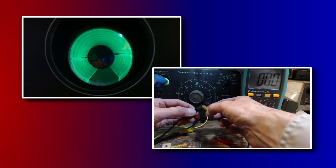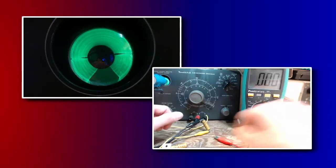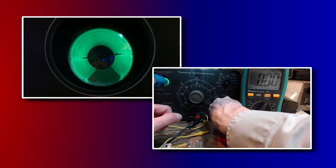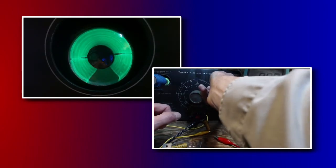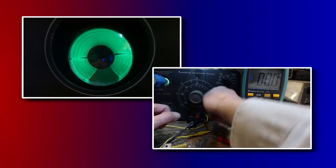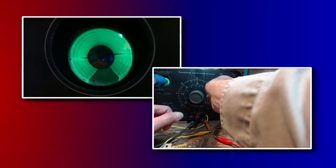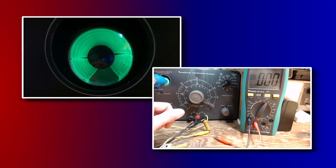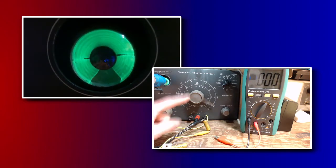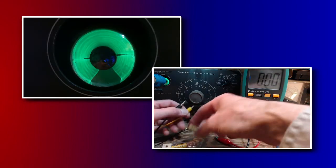This is C2. This is 350. It's a very good capacitor. The top voltage this will test at 450. So this capacitor is testing very good. Interestingly enough, the meter readings, the capacitance readings, are accurate. So not leaking, getting an accurate result from the meter. And this is what I think I'm going to discover, that leaky capacitors don't test well at all.